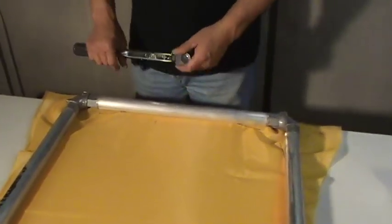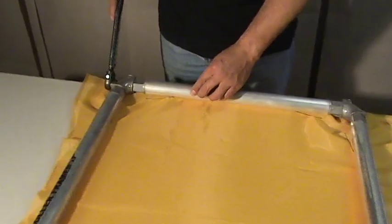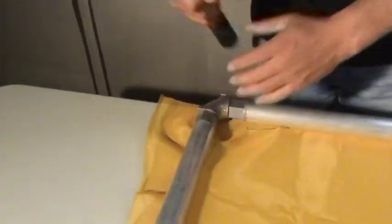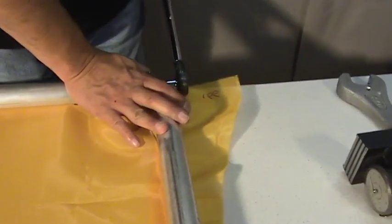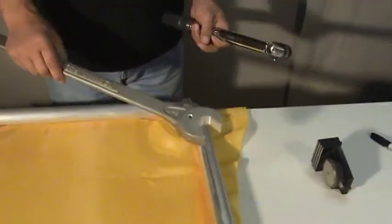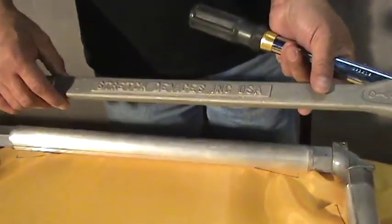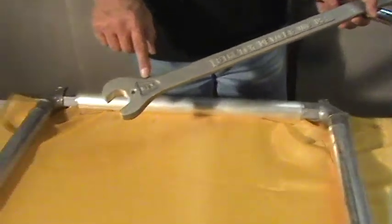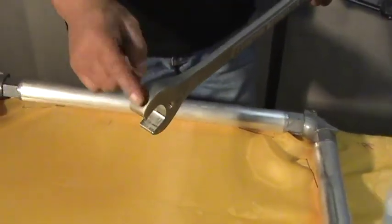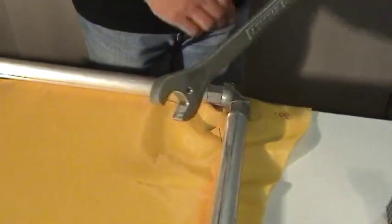Take your Newman torque wrench and loosen the bolts on both ends of the short rollers about 3/4 turns. Take your Newman open-end wrench. As you can see, there are 2 ends to the wrench. One is for the MZX model, the other is for the M3 model. It has a wide head to fit and engage the rollers properly.